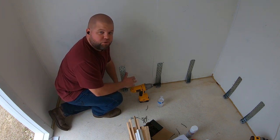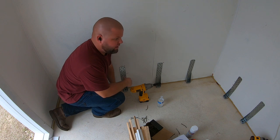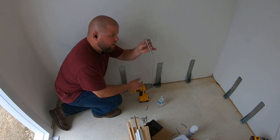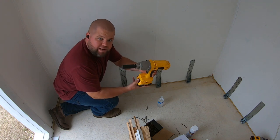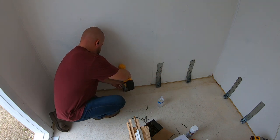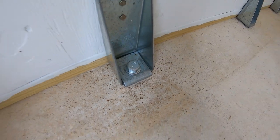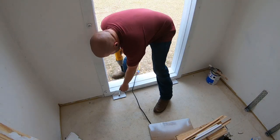It's starting to rain on me so I may have to cut this job short today. I'm literally having to take a break after every one of these — that's a lot of bending over and nailing. I'll go out, do something else, come back, nail another one after a couple minutes, get a sip of water. But this rain is about to shut me down. I want to go ahead and drive one of these bolts in and show you how this is going to lock the structure down. This is my old 18-volt DeWalt impact — that's another reason I want to go with DeWalt, they bought that adapter and I can run my new 20-volt batteries in it. Now you can see we have got that bolt driven five inches down into the concrete holding it in, with the straps going all the way around.